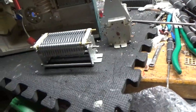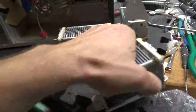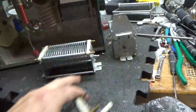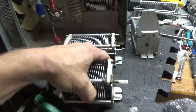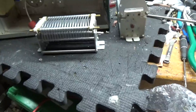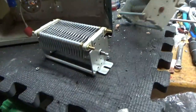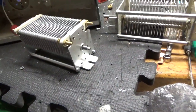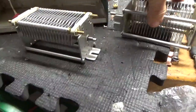Normally — here's one out, I already ripped the plastic piece off — the total capacity of the stock Heathkit one is 250 pF, and the AL80B is also 250 pF, same plate spacing. The mounting hardware to hold it down is the exact same, as you can see.